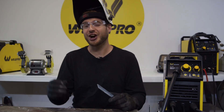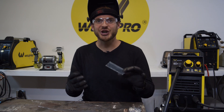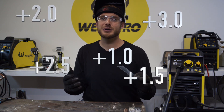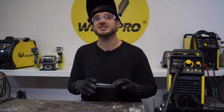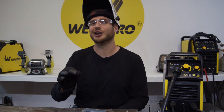If all else fails and we have to come to terms with the fact that our eyesight might not be what it used to be, they make cheater lenses. Cheater lenses are available for every size hood and in lots of different magnifications. I don't typically wear bifocals, but I do find that from time to time with very small welds, a cheater lens can provide a huge advantage. Hopefully these few extra tips will help you see that weld pool just a little better.